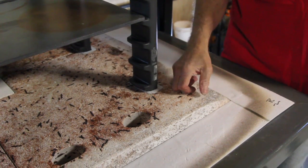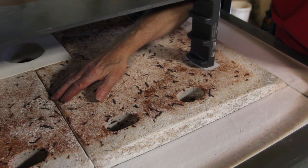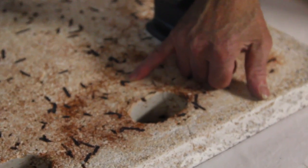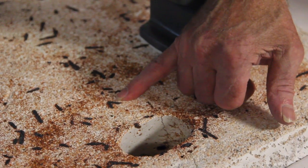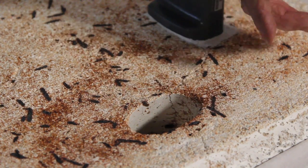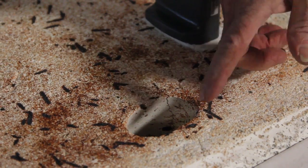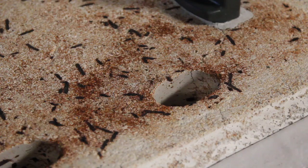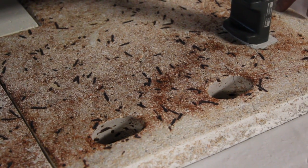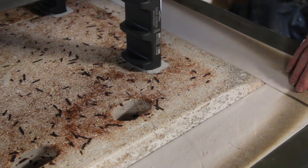This is the kiln pad. The pad is cast in four quadrants to allow for expansion and contraction without cracking. The castable is a high-temperature refractory with stainless steel crimped wire reinforcement mixed in. On the surface it burns up, which isn't much of a problem, but inside, if the refractory cracks, the stainless steel reinforcement keeps the cracks from propagating — keeping the pieces together. This has a few cracks in it but nothing substantial. This step seals against the fiber, and this is a piece of fiber gasket material that also seals.